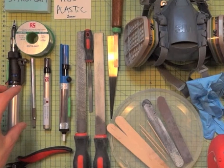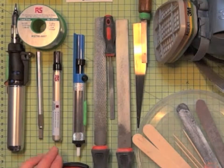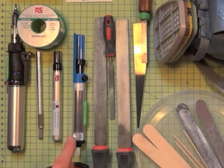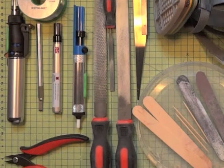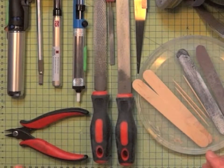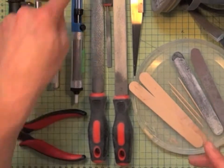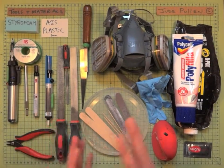We've got all the soldering gear for taking apart the circuit board of the wireless mouse. A square-edged scalpel blade is very useful for removing the lacquer off the top of the circuit board, and also using a flux pen to help the solder flow. A solder pump is incredibly cheap and can save a lot of stress when removing switches from the printed circuit board, as can a good quality set of wire cutters or angle clippers — useful for cutting legs of components but also for chopping ABS plastic when making holes.